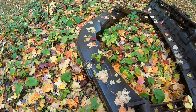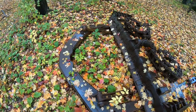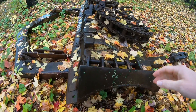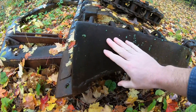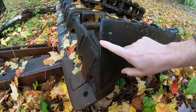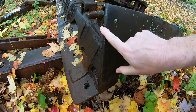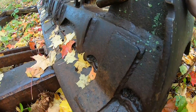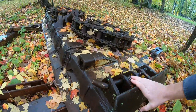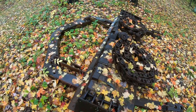It's so massively overbuilt. The C-frame is ridiculous. The blade moldboard is equally ridiculous. The reason I'd never do anything with this anymore is that someone has worn the cutting edge mounting all the way through the frog and they just welded the cutting edge to the bottom of it. And the rest of it's got some issues as well.